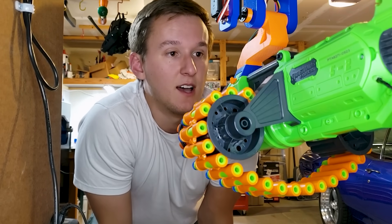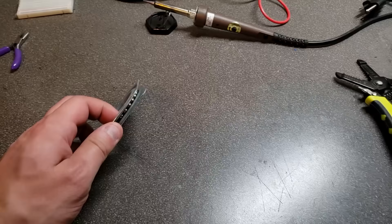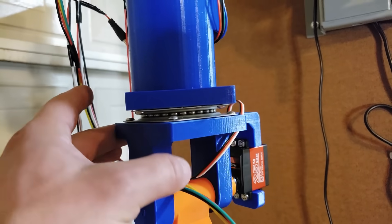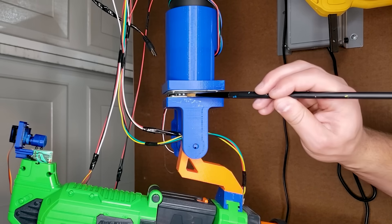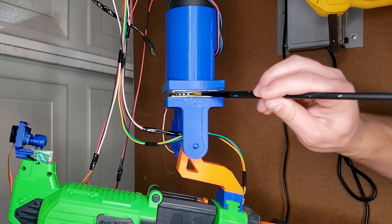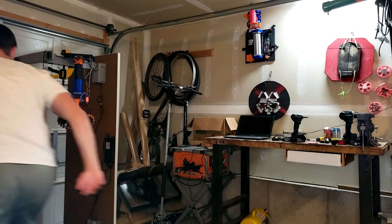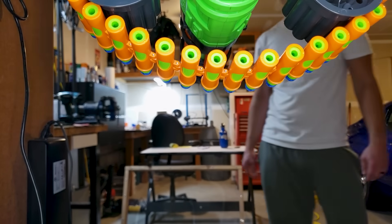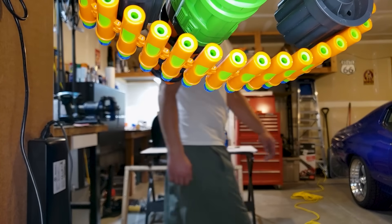This was completely false. Well, the skipping steps part was true, and I'm blaming that on the bearings — Lazy Susan herself must have built these because they suck and don't rotate smoothly. I oiled Susan up in an attempt to fix my failing project and at first it seemed like the issue was solved. But I soon realized the stepper motor simply didn't have enough power for this to work correctly and I'd have to increase the torque using gearing.